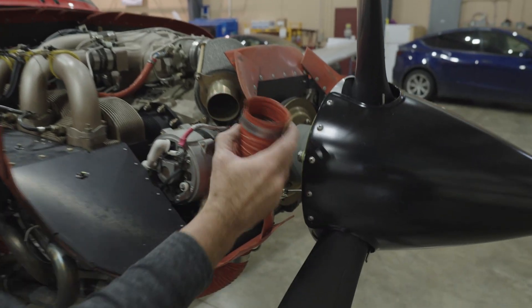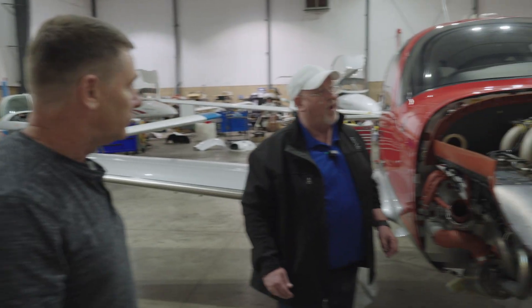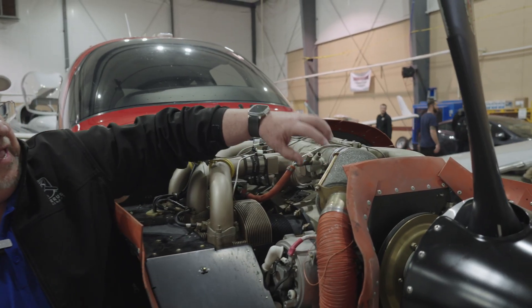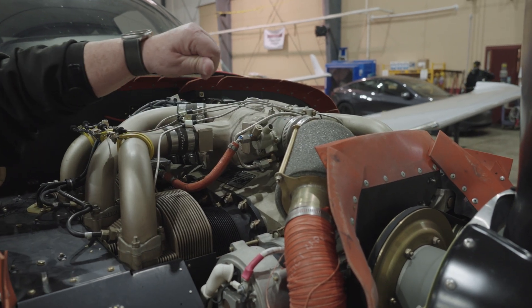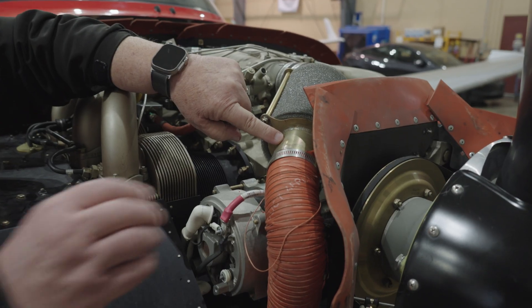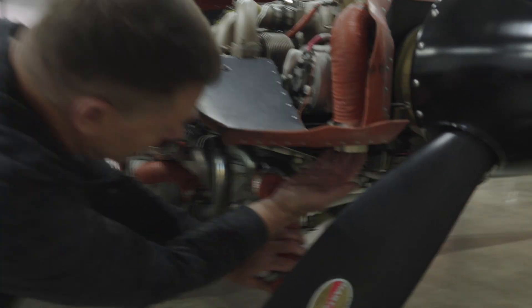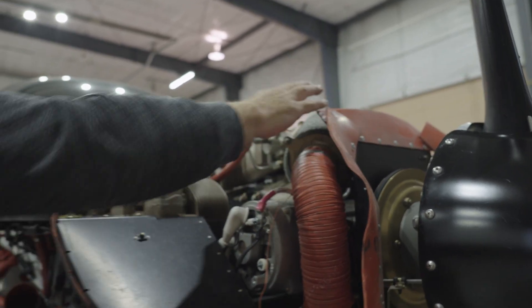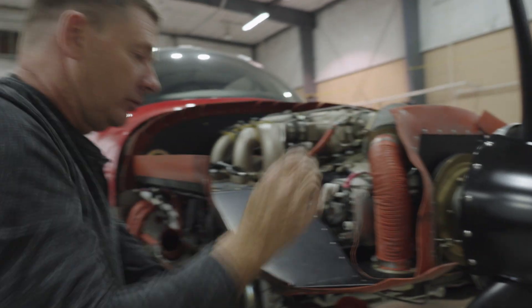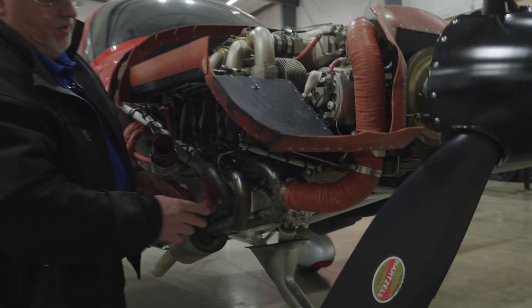We can see it will take the alternate air out of the scat tube through the hole and bypass the air filter to keep the engine running in the event of an ice-over or water situation. Normally the air goes through this filter. If the filter plugs up, it can't breathe anymore — it's just like us having a mask on our face that's all frozen up. The engine is pulling an enormous amount of air, and it's now going to start pulling air through this hose on the inside of the filter, bypassing the filter. So the pilot selects the alternate air on. There's a valve here in this port that the pilot selects. So right now it's in a closed position, taking air through the air filter. The pilot will open this valve, and at that point it will take air through the scat tube and bypass the air filter through that duct.